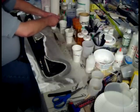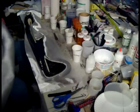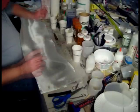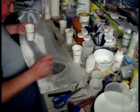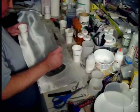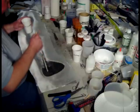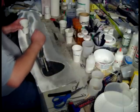Now I'll take a layer of 6 ounce cloth and lay it in place. I can be a lot more aggressive with the filler using the 6 ounce cloth because it will just kind of mold and squish it into shape. I've got to hurry up because I've been going for 30 minutes — that filler has about 50 minutes. I've got to get the other half into thin film before that filler starts setting up on me, so I have to hustle even though I'm using the longer hardener.